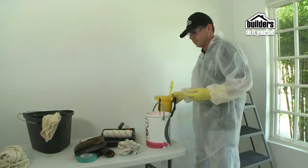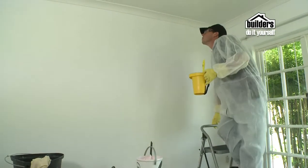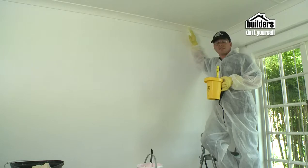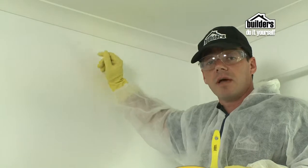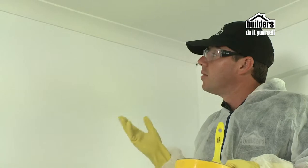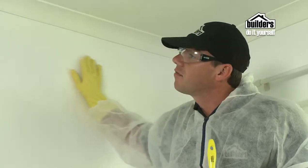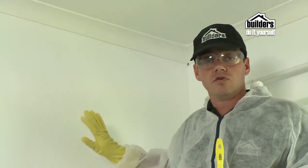We're going to start our cutting in now. Remember when cutting in cornice, it's always best to use a brush — the roller is just not going to be able to cover the intricate edges and sides. If you don't have a cornice, always allow 100mm extra overlap so that when you roll on, you make sure you cover over the cutting area. If you are painting the entire room, you don't need to mask up the area, but if you're not going to be painting the walls, you might want to cover the walls with plastic and mask it off so you don't get any ceiling paint onto your walls.